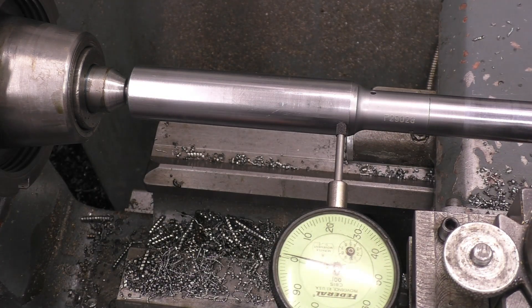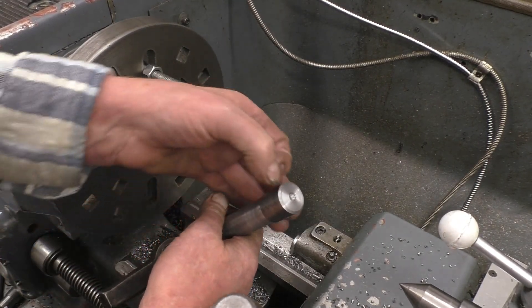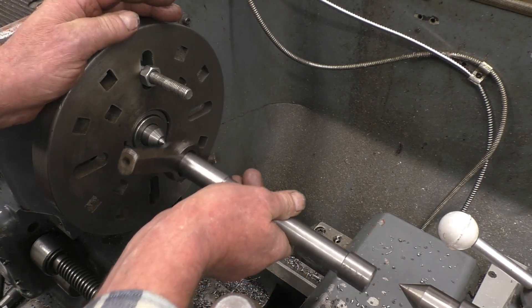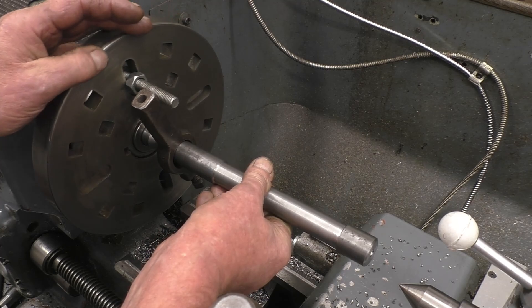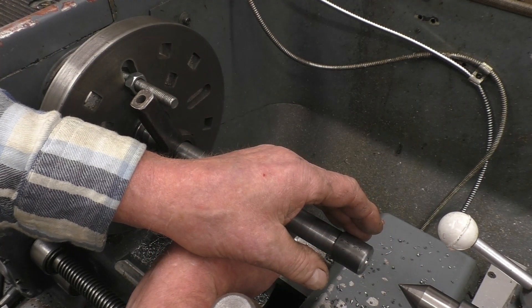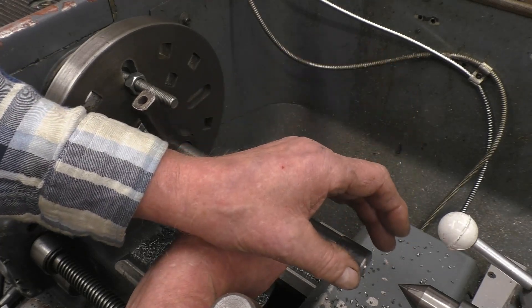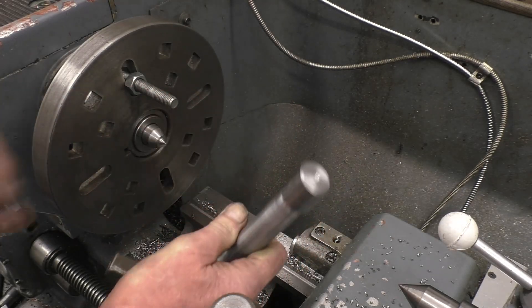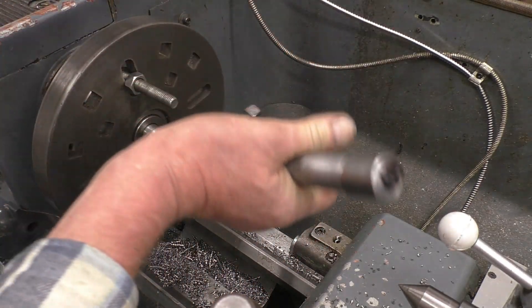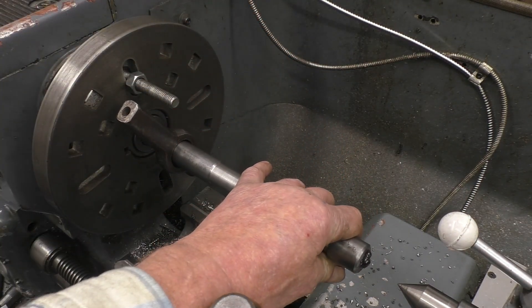Right, that's pretty good. This is the final method I use to line things up. I've got a mild steel bar here, it's been centre drilled in both ends, and I'm going to mount it between centres. I'm not going to use a live centre at this end — I'm going to use a dead centre, a little centre that doesn't rotate, just to remove any eccentricity from the lathe centre. It's just a little bit of high temperature grease in the end, which is the way it was done before they had all these cheap imported live centres.